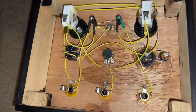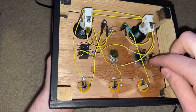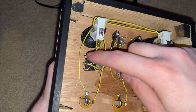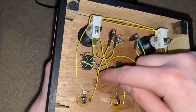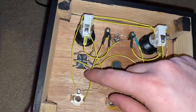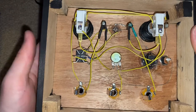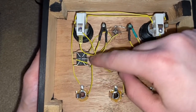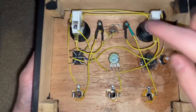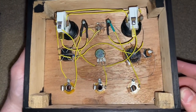Pretty simple — I know it looks like a lot but it's pretty simple. The flickering tea light candle connects to the top here, and the bottom is the VACTROL LEDs. In normal mode it's just all four of these, and then once you switch it, the VACTROL LEDs are connected in parallel with the tea light candle, which makes those flicker as well and creates all sorts of visual glitches, which I'll show you in the demo.